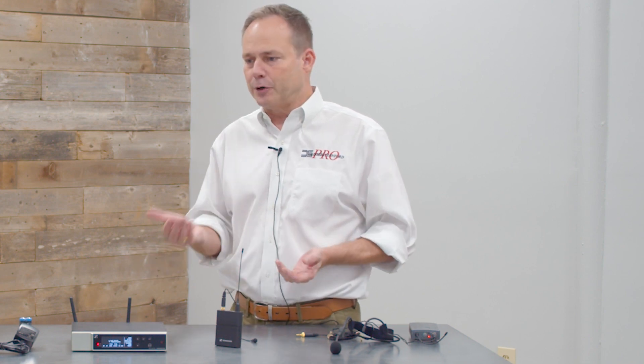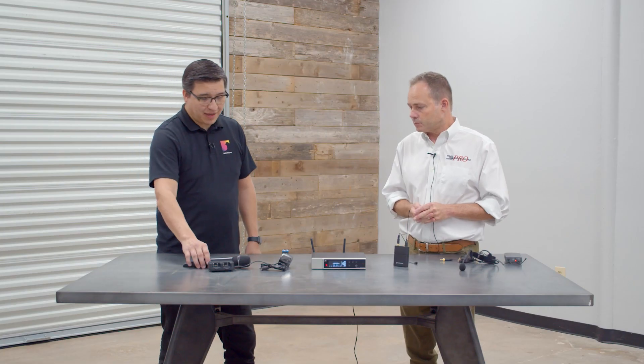Something very important: we're dealing with digital audio, and the problem with a lot of digital microphones is you have to convert analog to digital, and then it may go into Dante or a digital mixer, so you're dealing with latency. The Sennheiser EW-D has 1.9 milliseconds of latency — it is the fastest digital microphone on the market. In some cases it's half the latency of a competitor. When you're dealing with live music, arrival times are very important, and for a budget microphone to have the best dynamic range, the best capsule selection, the best frequency response, the lowest distortion, and the least latency is a game-changer.